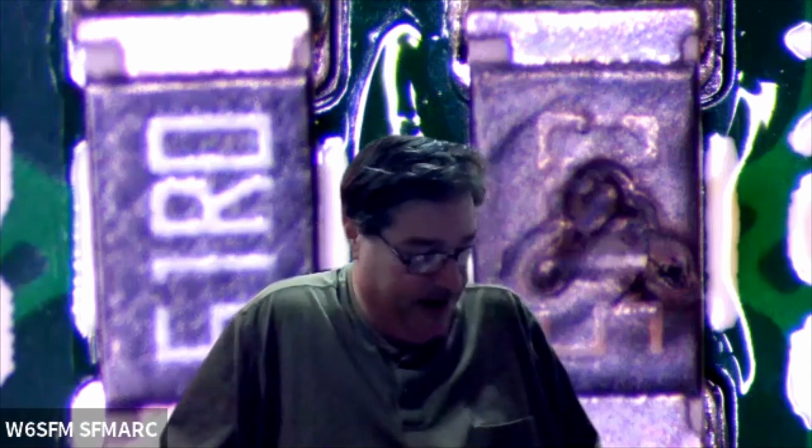You know, it's funny, I had another guy who said the same thing. I loaned it to him, so it must be warranty because I didn't cause damage. But I get all kinds of stuff like that. It looks like it got hit with a soldering iron or something. No, that's what happens when RF goes through a 1/4 watt resistor. It's a surface mount resistor, so that's taken with a microscope. What are those, 0402s or something? Yeah, those are tiny. They're like smaller than a grain of rice.